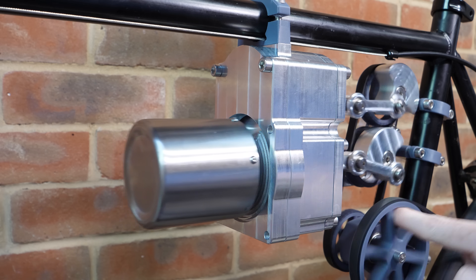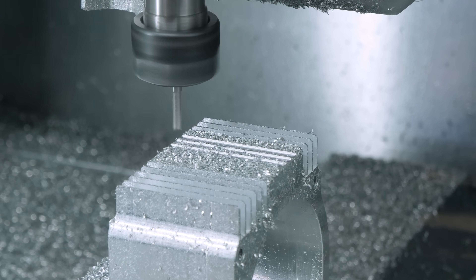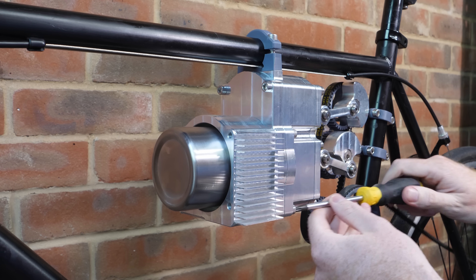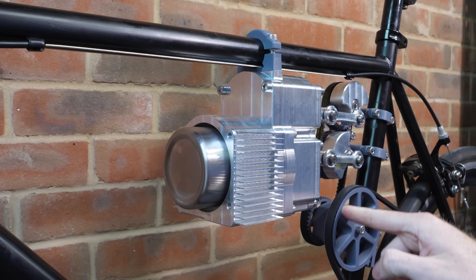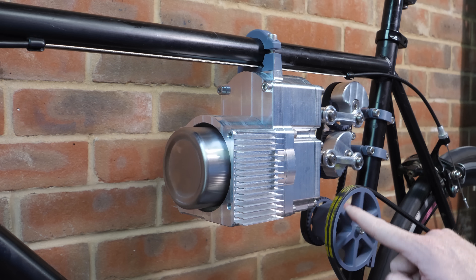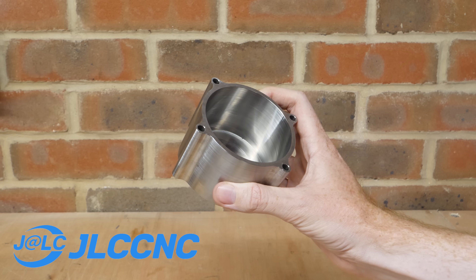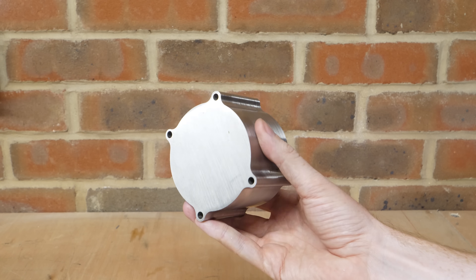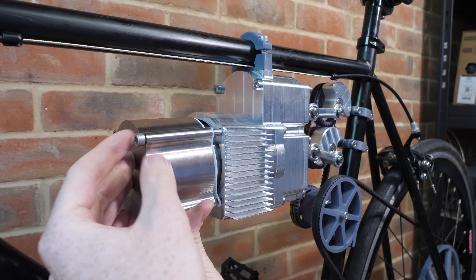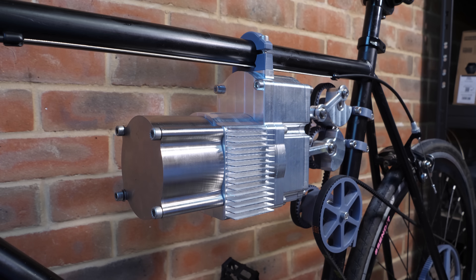Next, I need to make the displacer cylinder, which I decided to build in two halves. The cold side is machined from aluminium with added fins to help it stay cool, mounted to the main engine block with a gasket that also insulates it from the water cooling. The hot side needs to handle much higher temperatures, so ideally it should be made from steel. Since I'm not confident machining steel just yet, I had the hot end made by JLC CNC — there's no way I could have machined that part myself. It's mounted to the cold part of the cylinder with a thick silicon gasket to insulate the two halves, so heat doesn't conduct through to the cold side and get wasted. With the hot cap tightened down, the engine is fully sealed — all it needs now is heat.